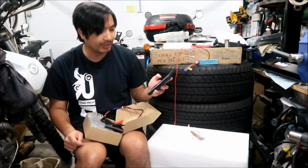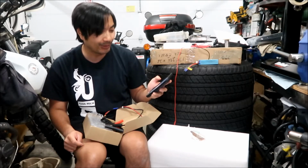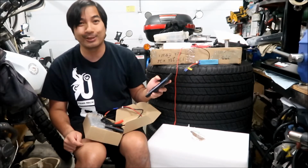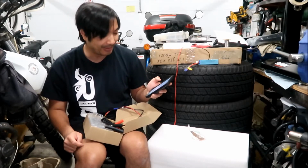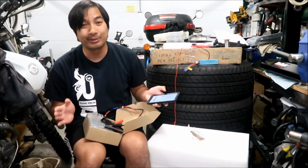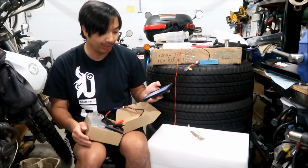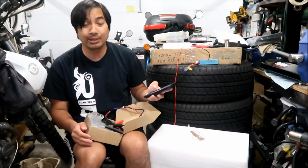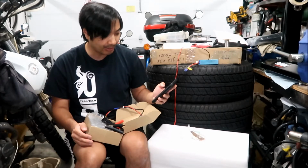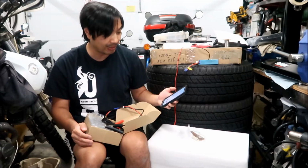It says it's a lithium iron phosphate LiFePO4 fast charger for a 24 volt 8S e-bike, forklift, golf cart, touring car, scooter, iron phosphate battery. It's a really weird name, but it's a 24 volt lithium iron phosphate charger. An 8S will get you 24 volts-ish. The options I chose are an XT60 connector, and it charges to 29.2 volts when fully charged, at 10 amps. That's the charger I got.